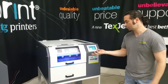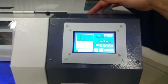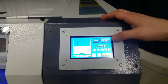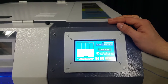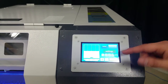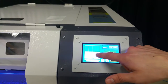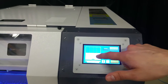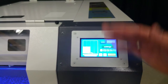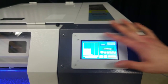Now we can go into the functions. We've got the water function just like the 3 to flush out your lines at the end of the day. You've got your pre-coat function, which is your pre-treat — this was made in Germany so you can understand why they call it pre-coat. You've got different pre-sets, so you can pre-set for, let's say, a lot of left chest. We can just de-activate those nozzles and set our settings for the length and when we want it to begin, so we can have different pre-sets for different jobs.